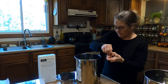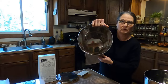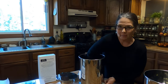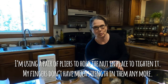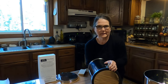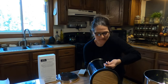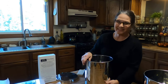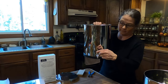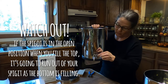I just want to show you really quick what it looks like on the inside. Those silicone gaskets are going to squish up against the hole on the bottom of our container here. Tightening — holding the nut with the pliers and tightening the spigot is working for me. That looks straight up and down. So like I said, do not over tighten it. Right now it's closed. This would be the open position. So if it's running parallel, the same direction with your little spigot faucet, it means you're going to get your water out of here. Let's close that up.